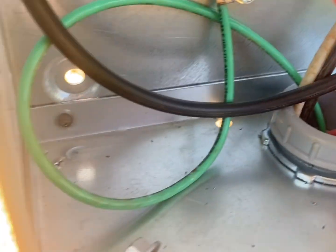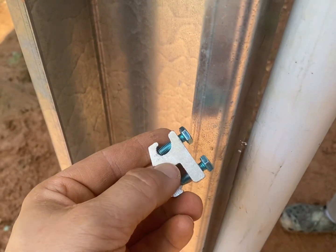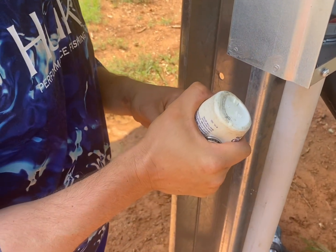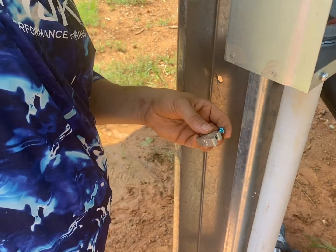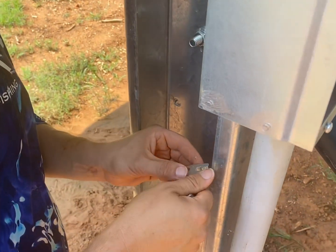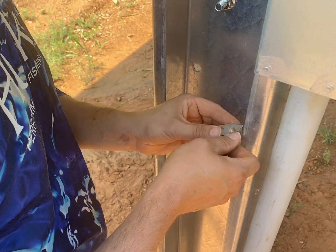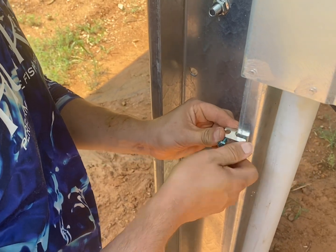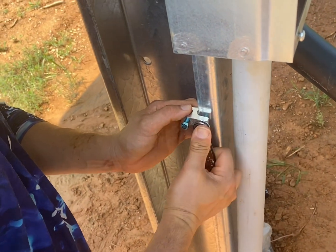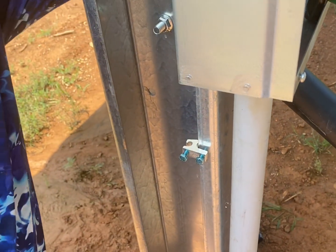Get a hole right below your ground bar — there's my hole — and I'm going to bolt this on to the steel and run a piece of ground wire through that. In the manual for these they want you to use a little bit of antioxidant where this thing goes on. This little sucker just bites down wherever I engage it. Get a little bit of the antioxidant on the screw. The teeth on this bite down into it and cut through the galvanization.